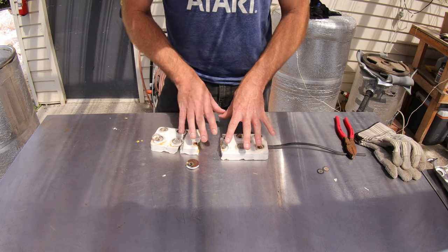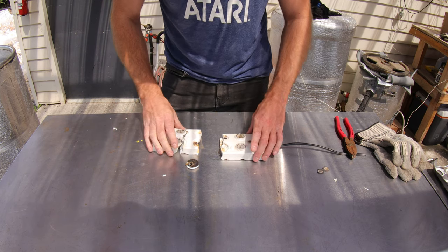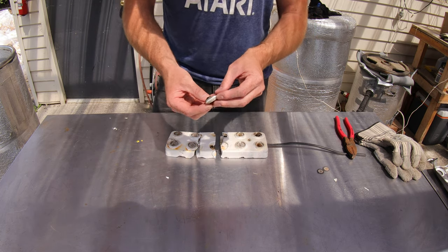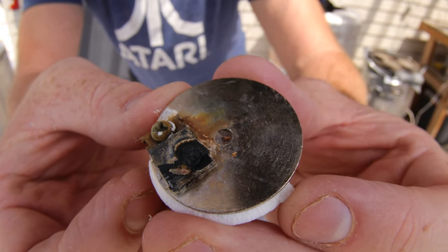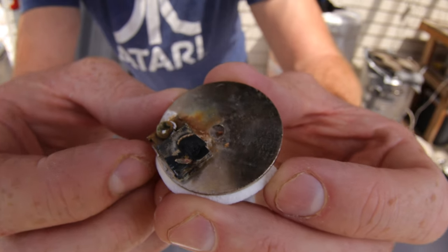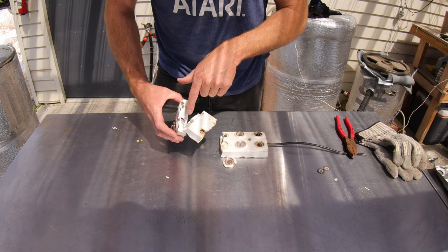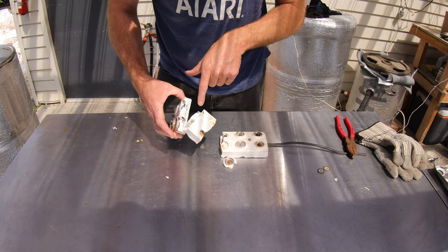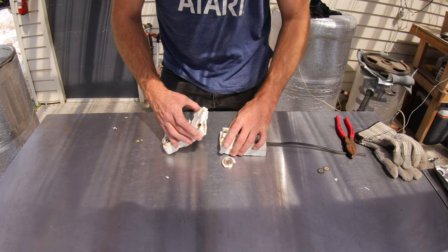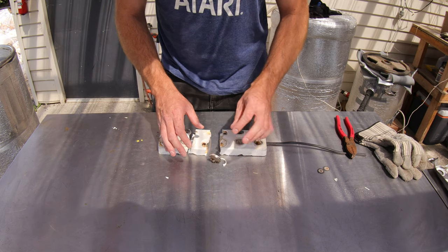Before I did this, I tested it with a brand new power supply and it would trip straight away, which told me there was a short in here — and there's the short you can see where it's burnt out. I also broke it further down, and looking into those other transducers, there's no sign of rust damage whatsoever. So that tells me water ingressed through this top plate and blew it.